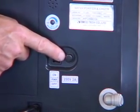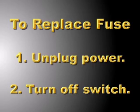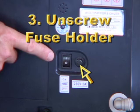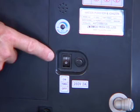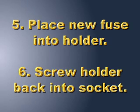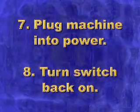If you ever need to replace your fuse, this is the fuse holder. Begin by unplugging the power cord and turning the machine around to access the fuse holder. Just to be safe, turn the power switch off. The fuse holder is right next to the power switch, and it's a threaded component, so simply unscrew it to remove the old fuse. Pull the fuse out, insert the new fuse into the holder, and reinsert the whole assembly back into the fuse holder, re-threading it — finger tight is good enough. Lastly, turn the machine back around, plug it back into the wall, and power it up.